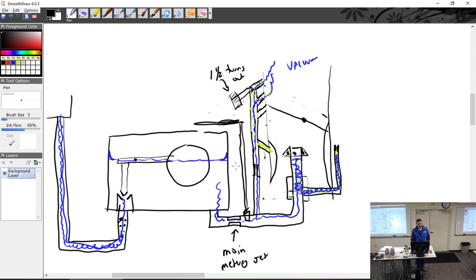If you really want to think about it, all the pilot is doing is pushing forward on the mixture, which pushes a cable, which has a little arm that just rotates. And so you're just closing off the mixture. You're closing off the main metering jet just a little tiny bit, making that main metering jet in effect a little bit smaller. Of course, the main metering jet stays the same size. You just close the passage off a little bit. Less fuel flows through here. And you can continue to pull it and pull it, and it just keeps getting smaller and smaller until eventually it blocks off all of the fuel.